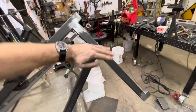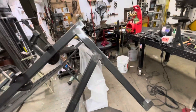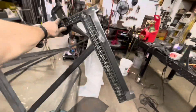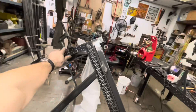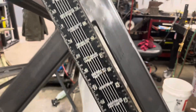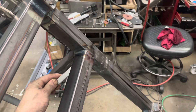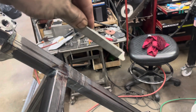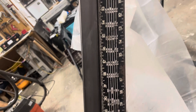This leg bent down in the picture because of all the heat input on that side, and we had a pretty significant difference out of square for the beginning portion. After the weld it bent, having all the heat input only on one side of this member. As it cooled, that heat input shrunk and contracted. As you can see, after a straightening session we're pretty close — we got everything a lot closer to square.